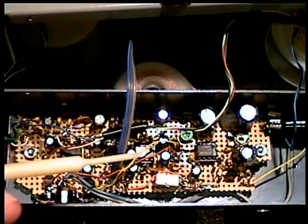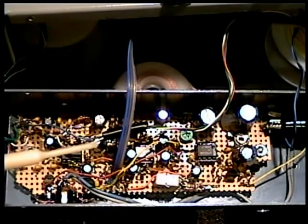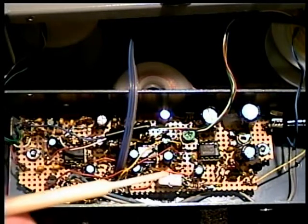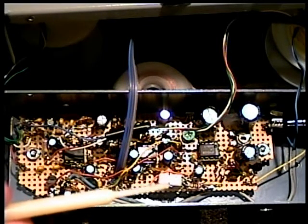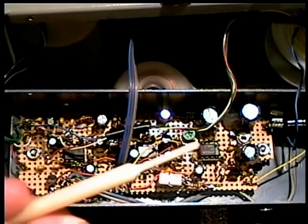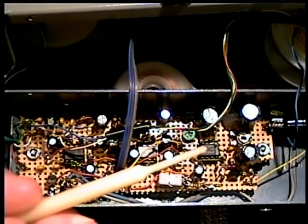The second IC — the other LM833 — is set up with a gain of 10. Ahead of it, we have another pair of transistors used as a DC volume control, but this is automatic. The capacitor here is a 1.5 microfarad poly cap that smooths and filters the ALC voltage. Out of the LM386 we have a good amount of current available through a 330 microfarad capacitor.